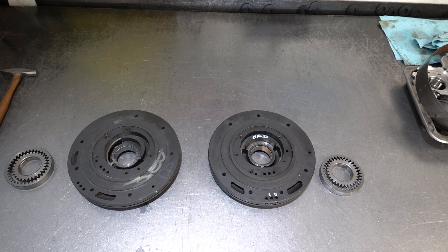Welcome back to another video. This one's a follow-up to the C6 FE series teardown where there was engine damage that caused some collateral effects on the transmission, requiring us to replace certain parts including the gear sets — or at least the front and rear planetary carriers — as well as the pump body. In that video I didn't really get into the pump damage; I wanted to keep that video under an hour.